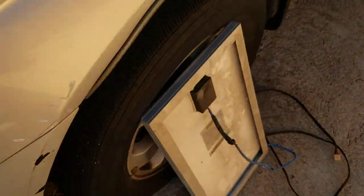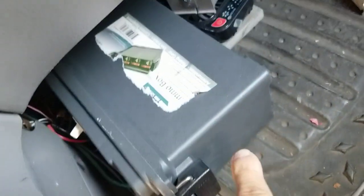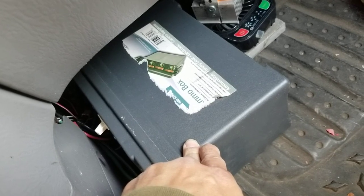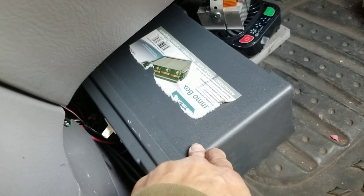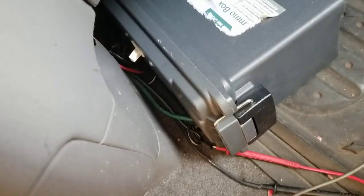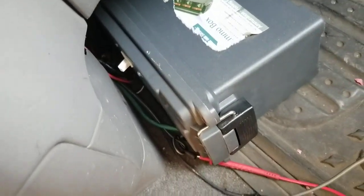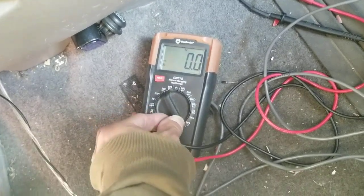You can use a solar panel — big or small — to top it up. If you haven't watched my old video about the battery bank I built: this one uses 18650 batteries, 20 in each series, times 3 to make a 12-volt battery — so 60 batteries total in here. I use the Daly BMS. I have not fully tested the Daly BMS yet, but I think it's working. I will have to cycle it many times to find out.